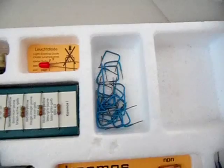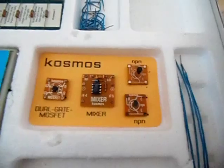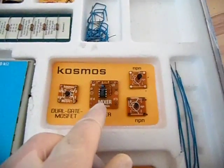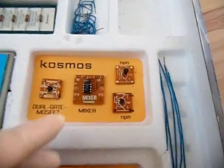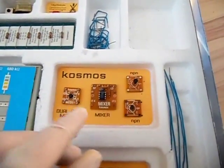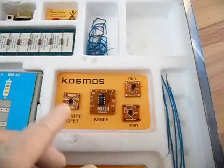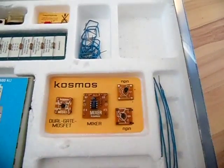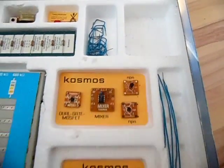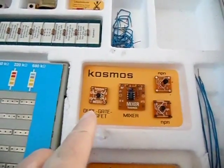Here we have an LED, long-leaded connectors, and two NPN transistors — nothing special, standard transistors similar to the 2N3904. There's also one NE612 mixer integrated circuit, which was very common back in the day — I've read it was used in cordless home phones. You can still get this chip, but it's quite vintage and rather expensive.